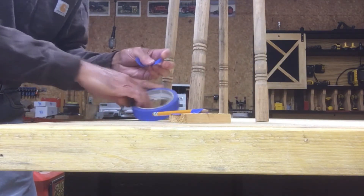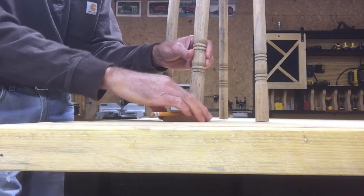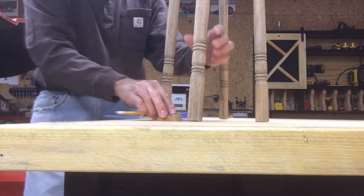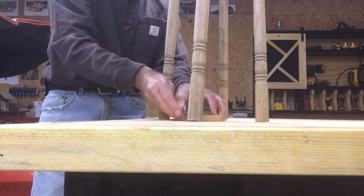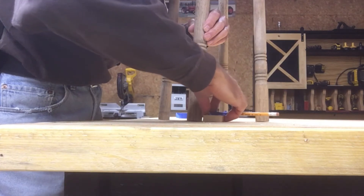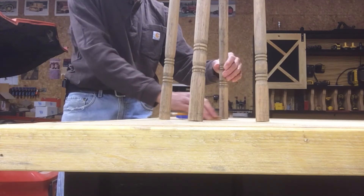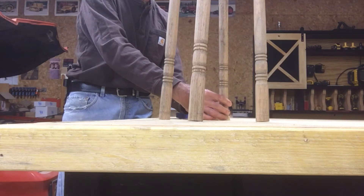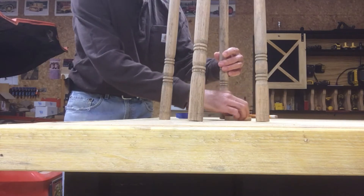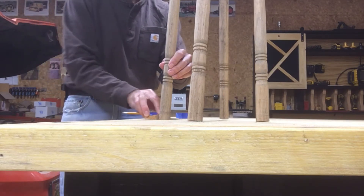I'm just going to put another piece of tape on here — I don't want this to move at all. Then you just go around and mark it like this with your pencil on the nice level workbench. Just make sure if it's a workbench, it's level — it could be a concrete floor, just whatever, just make sure it's level. This is the one that's really off — see? So that's level right now, so this one's going to be cut less than the other three. That's how this works. I'm marking it so I have to make sure to keep it the way it's supposed to be. So you just go around like this and mark it.